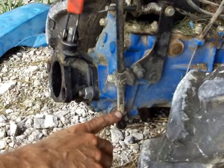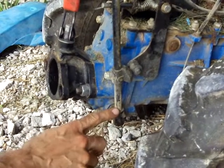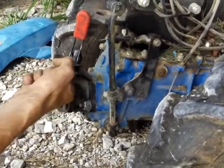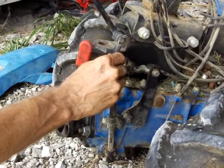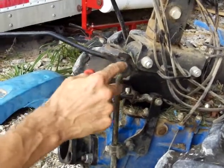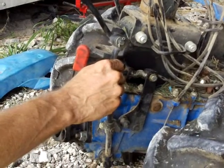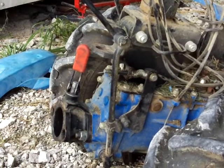If this freezes up and won't turn around, you can soak it with penetrating oil, put a little heat to it with a propane torch, or grab it with vice grips or channel locks and try to get it freed up. Because if you put too much force on it via the shift rod — which connects through a plastic joint — you're going to twist that plastic joint off fast. If this thing is frozen and you just try like heck to swivel it via the shift rod, you're going to shear that plastic off or deform it so badly it can't be used.